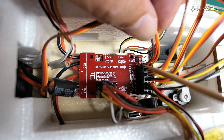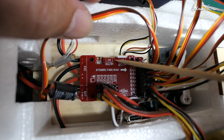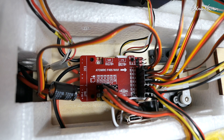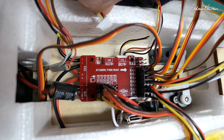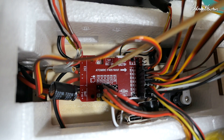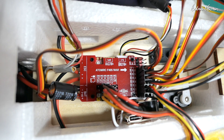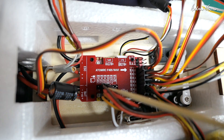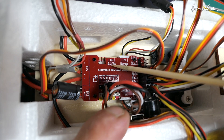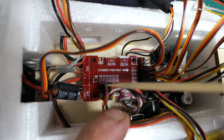My pan servo for the camera is plugged into S7. For the GPS, if you're using the existing BN220, it comes with the right connector plug to plug into the flight control board on UART4. I'm not using that GPS so I've got a different plug — I've plugged mine into UART3. So you have to make sure in the ports tab that you swap the GPS from UART4 to UART3, or whichever UART you plug your GPS into.